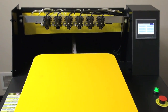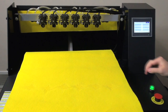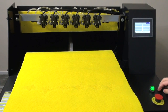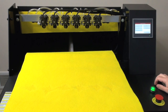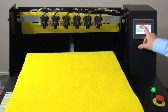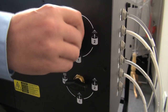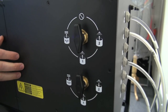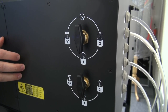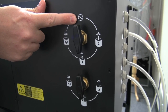Place the supplied chamois on the platen. In the menu, press the fluid maintenance button, then press the fill button. Turn both valve selectors to the desired fluid position. For normal setup operations with a single pre-treatment fluid, this would be the closed position for the valve.